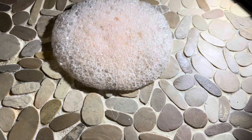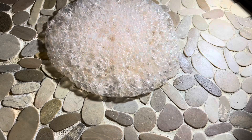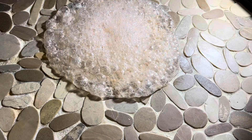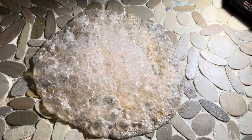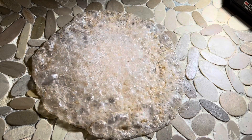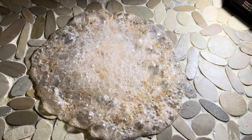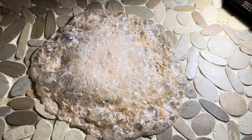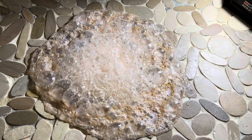The goal is to clean that scale and lime out of the pipe, make it smooth, and turn it back into a two-inch pipe. We're using muriatic acid here to loosen up the calcium deposits and the scale. I did speed this up and cut it so you don't have to watch the 45 minutes it took. I ended up doing it twice because I didn't get all the scale the first time around.